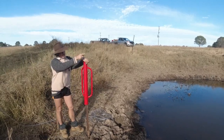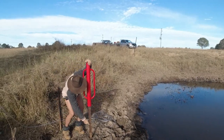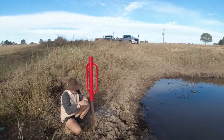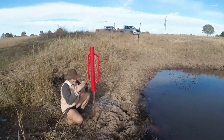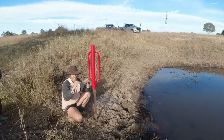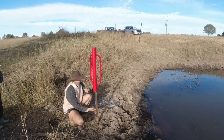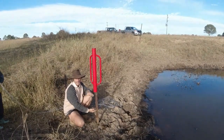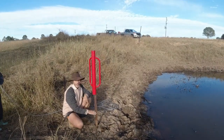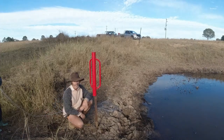This is the other end — the datum point will go over there with the water level, and the other end will come here. Because water makes its own level if you've got it in the pipe, it takes a little while. As you adjust the pipe up and down you'll see the water levels move at both ends. Once it sits still, that's the level. You slowly move the levels to the height required at both ends, and once it's settled with no movement, you mark your levels at both ends.